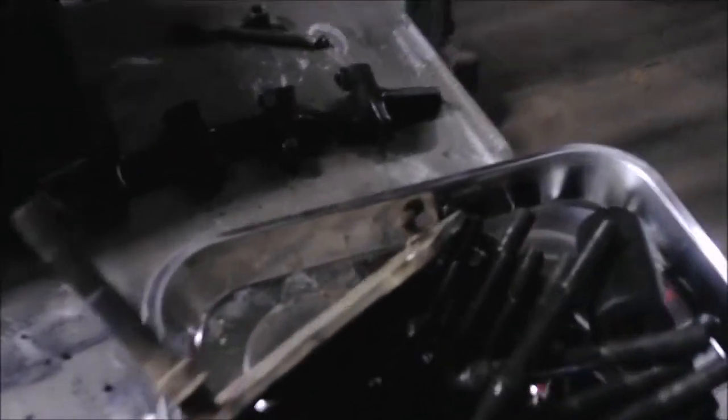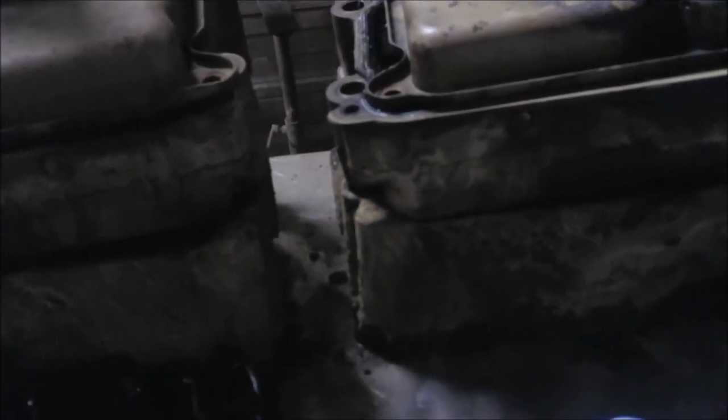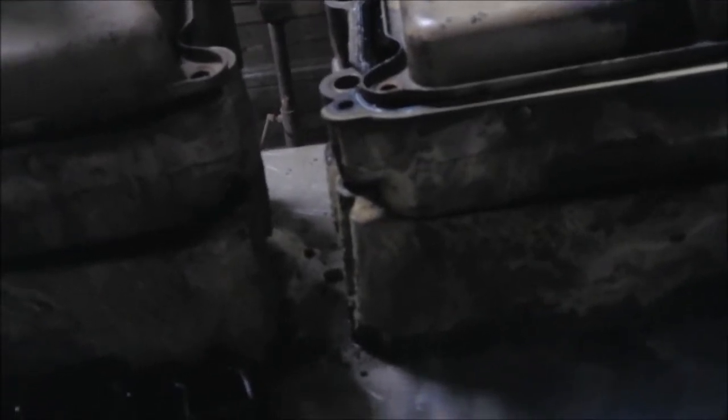Miscellaneous engine parts that come out of here. Broken line — we gotta get the fuel line that came off the back of the head figured out. Here's the piston cooling nozzles — these are all intact. The one that broke, we don't even know where it is. We just found this portion in the bottom of the pan. Counting them up — one, two, three, four, five — yeah, there's one missing. This is what we found in the bottom of the pan, which attaches here and bolts into the side of the block. We got the injectors out. The heads are at a machine shop in Winona currently, getting checked and surfaced if needed. They needed new valve guides — those were bad. That's where we're at with the heads.